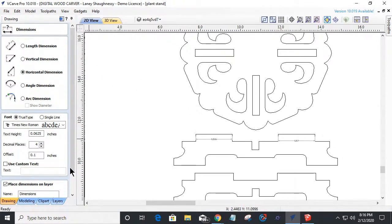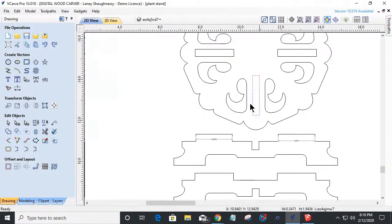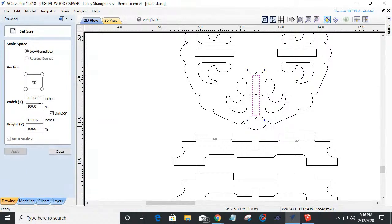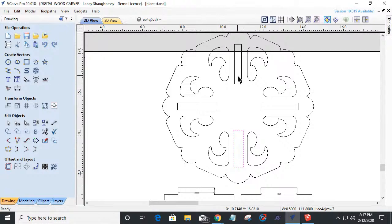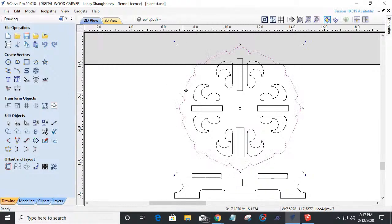So then that means my rectangle here, my notches here, need to be sized 0.5 inches wide by 1.80 long. Okay. And then I need those notches to match that all the way around. Now, if these things are centered, this measurement right here is the center of this oval, that little pivot spot there. If these are centered, it's very simple to just go in and change all the rest of these to the same 1.80. But I like playing around with tools and stuff.